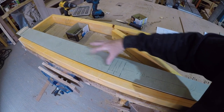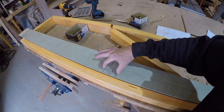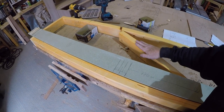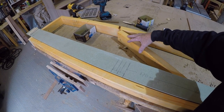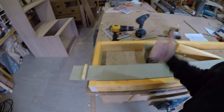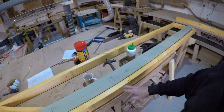That is a carcass, this is a carcass. This is a front piece of oak that goes to cover the two edges. And the doors will be either side of it. So I want to put my frame so that it's sitting underneath the join of the two carcasses. And we've got 25 millimeters at both ends. Yeah, so I'll go and do that now.